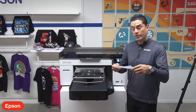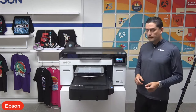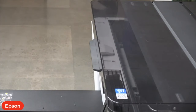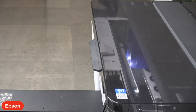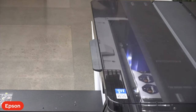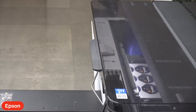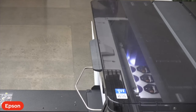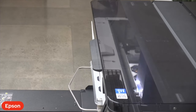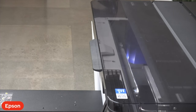We're going to switch gears because we have a hybrid printing system — we're going from printing on the garment to printing on a digital transfer film. I was easily able to switch from a garment to film without making any adjustments to the platen itself. This is thanks to our garment thickness optimization. There are sensors underneath the cover that measure what is loaded on the platen, and the print heads inside the head carriage will actually adjust to the appropriate platen gap distance — it's like having autofocus for your garments.